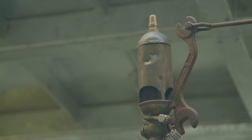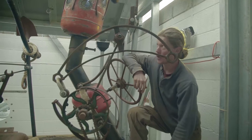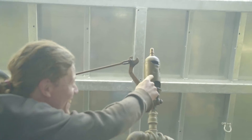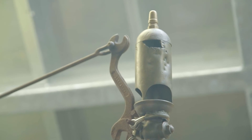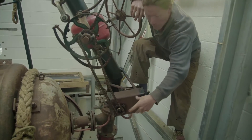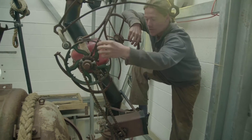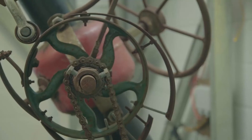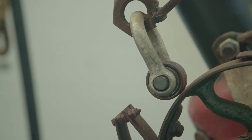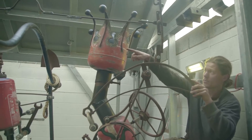There are two whistles — two steam whistles. The small screechy one is actually an old American steam train whistle, complete with little bullet holes. It's powered by a truck windscreen wiper motor inside, waterproofed, with gearing to run at half speed. That runs a snail cam which tilts this, which then pulls a lever connected to the whistle.